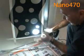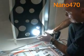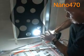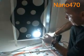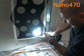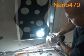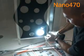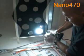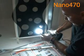Now, once we've done that, we'll go to the back. The stencil is 1 millimetre thick, and the adhesive, through suction, holds the bevel on, even though it's not cured. So, holding the white light behind the bevel, we don't really have to hold our finger on them, but we need to make sure the stencil is flat on the glass, because we don't want our bevel to slide behind the stencil and down. That's why there's a bit of tape here holding it nice and flat.